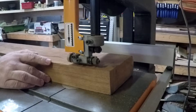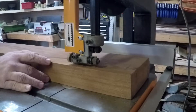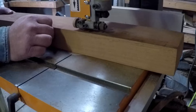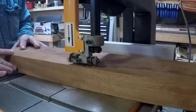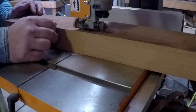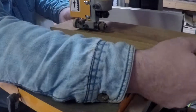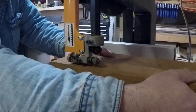To get this vessel ready for turning I first mill up a piece of the Spanish Cedar. The board I have is about three feet long, six inches wide, and measures eight quarter thick. It's a softer wood and cuts very easily. Each strip is roughly three quarters of an inch, and in between passes I would true up the cut face on the jointer. It was pretty cold that day, so I apologize for not moving the camera over to the jointer, but I just wanted to get in and out of my outdoor shop as quickly as possible.